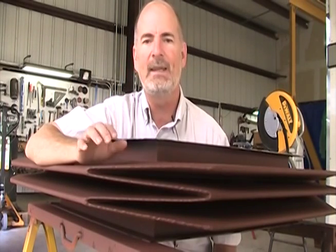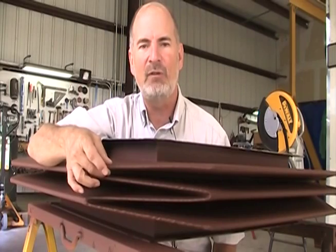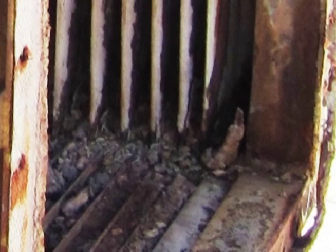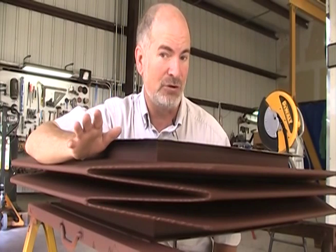Also, these things are stiff to begin with and they tend to get stiffer over time because these leaves are very tight together, and if you were to look on the inside you would see that. Over time, fly ash and things like that pack inside of it and cause them to get stiff, maybe even lock up, which will cause end users problems further down the ducting — problems they may not even associate with a metal rectangle.